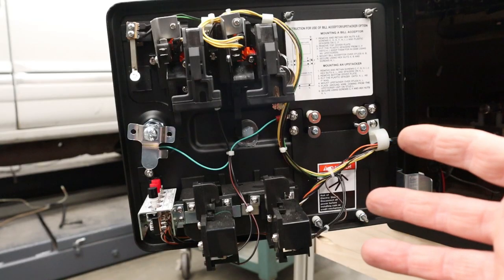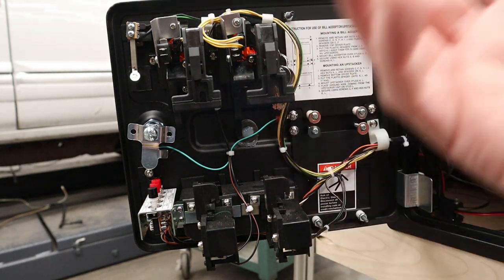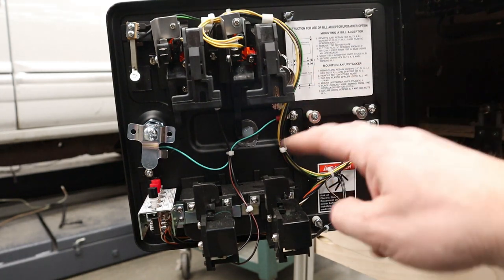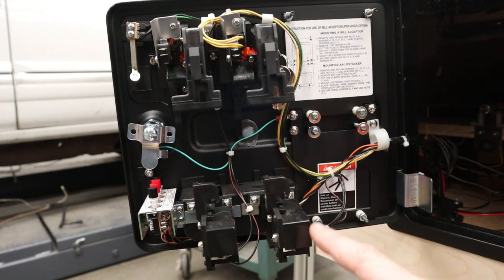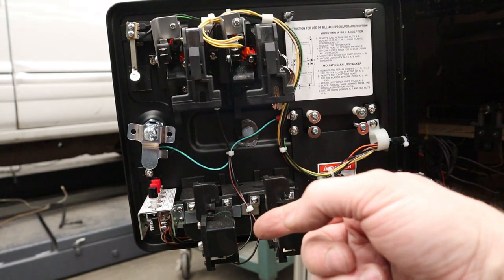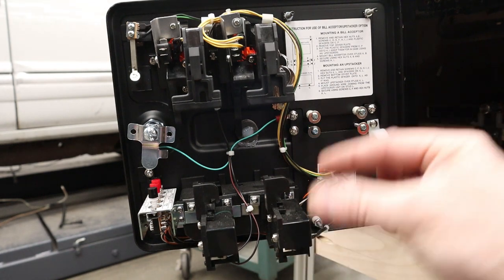Now to wire up these micro switches, essentially we just need a common ground and that purple wire from our KL25Z wire to come up here, and that will be all we need. However, we have a nice wire loom here for this coin door, so we could maintain that. And rather than cut into the wires here to get access to grounds and stuff, I took a couple minutes and thought about this. There are already two micro switches here to register when a real coin drops in and gives you a credit. So if we just tap into those two connections there, either by putting a spade on or even just soldering the wires to the connections where these wires are for our coin mechanism, then that'll do the same thing, and we can maintain and use those two wire connections in the connector for the coin door to make this work.